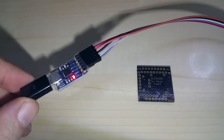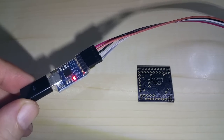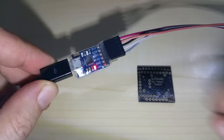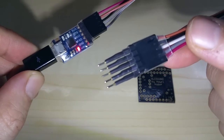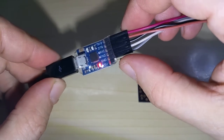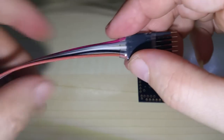Hello YouTube, this is a video showing how to upload code to my GSM alarm cube. This is my regular USB to TTL adapter — on this one I extended it with wires to pogo pins, because you cannot use 5 volts, you have to use 3.3 volts. So this is just an extension.